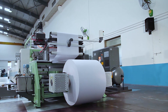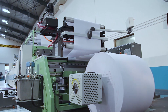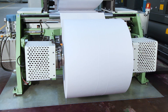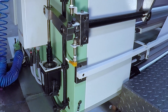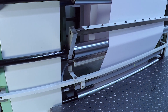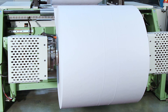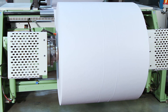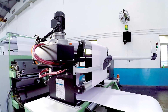The unwinding shaftless reel stand is a heavy duty, sturdy and strong reel unwinding station with floor pickup of the reel using a hydraulic system and mechanical core chuck. It has an automatic motorized decurling unit to remove curling from the paper to make it flat. The reel stand is also equipped with an air-cooled hydraulic disc brake on both sides, and a web guiding system for proper alignment of paper.